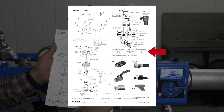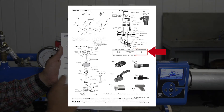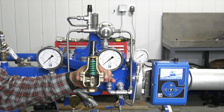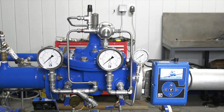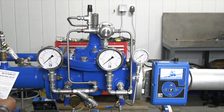On the chart on the far right you have PSI change per turn, and that PSI per turn is based on which color spring you have inside your CRD. In this one I have a green spring — that's a 30 to 300 range — the same one we have installed on our valve. We're going to go through some of the symptoms and probable causes you may have with your 90-01, going down the list with the IOM.